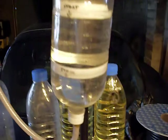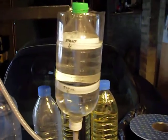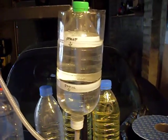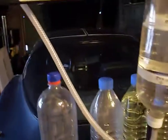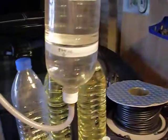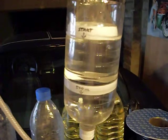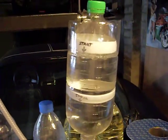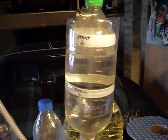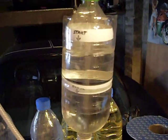Gas and liquid mixture back into the header tank. And I have replaced the bottle with this little contraption that you see here. It's an upside down bottle with water in it, and another bottle inside that, which will catch the gas as it flows through. When I shut the cap at the top here, you'll see that the bubbles start to flow through, and they go up into the inside bottle, which fills up with gas, and gives me a reading as to how long it's taking to produce a litre of gas.